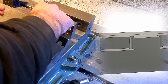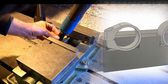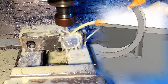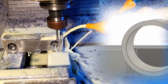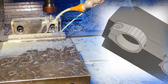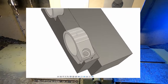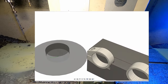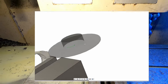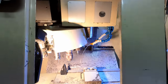We've got to flip these jaws so they can hold the main pivots to do the bolt holes. We're going to do a bore for the bolt head at the top, then drill for the threads and clearance, then take them out and tap by hand. Then we've got the slot cutter — it's a bit sketchy, a bit worried about this one — mainly because speeds and feeds is a bit of an issue, and it's going to be super close to the vise. Right, here comes the sketchy one — slot cutter.